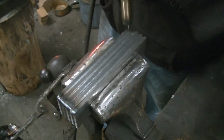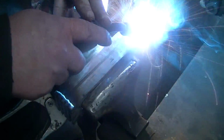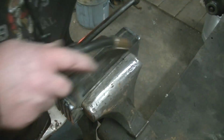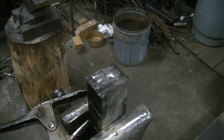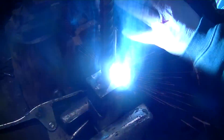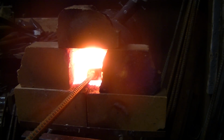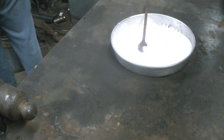Alright, I'm just going to MIG weld this thing in a few spots across. Now there's 1095 on the outside, which is the solid thicker metal to keep the blades from warping out on me. They did that last time I did this on a smaller billet. That was a suggestion by one of the comments in the video we did, where we were sort of testing this material to try to figure out what it was. And this is the biggest billet that I've ever forge welded together in a pattern welded sense. So we're going to see how this goes.